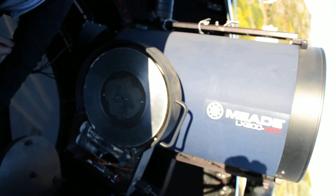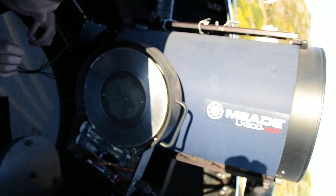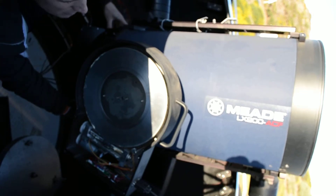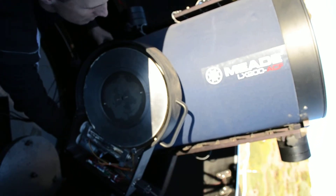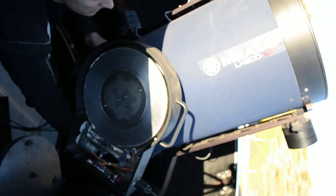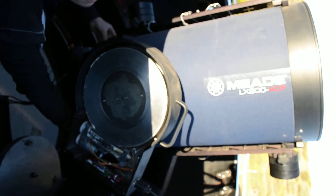There are several spots on the rotation of the declination axis where the motion is quite lumpy. You can see if I start to move it, it's currently sitting in one of them and it takes quite a bit of pushing to get it out, and then it leaves. The tube itself with all my kit is quite well balanced but there is a lot of resistance in the motion, and if I go back to this main sticking spot you'll see it rock in to the spot.